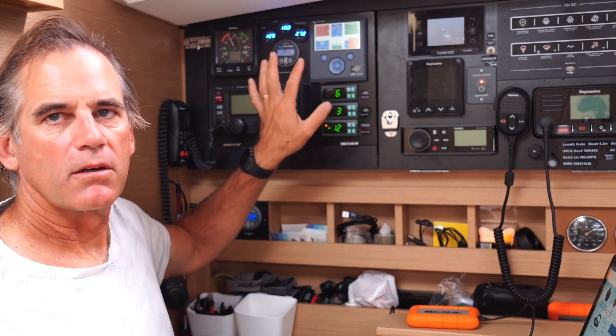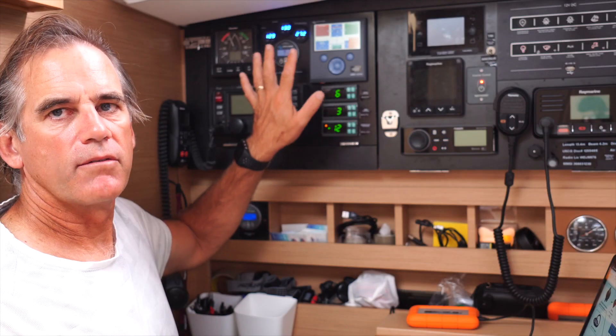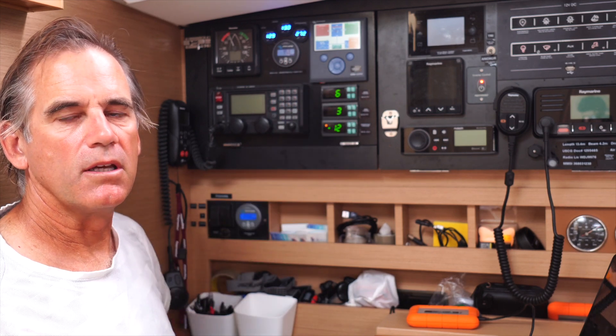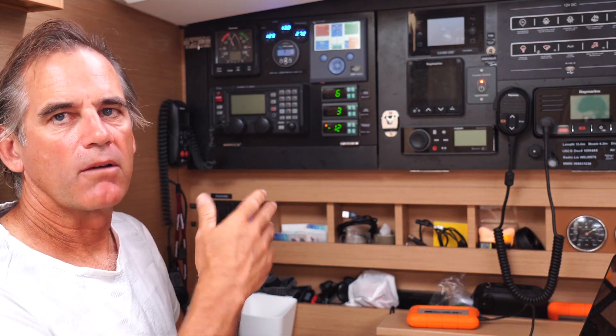The last thing I'll mention is these three round meters here in blue LED. These are very basic voltmeters often used as an accessory for a car. I bought them online — they're very cheap — and they just plug in and read the voltage of the battery bank. I've got three, one for each battery bank: house, engine, and bow thruster. This information is all available in the Victron BMVs, but I just wanted a simple, cheap solution. When I'm walking around the cabin, I want to be able to quickly see how the voltage is on the battery bank rather than scrolling through a menu. They're on all the time for an instant read, and I can quickly see if there are any issues.